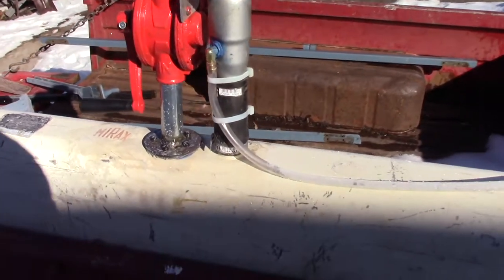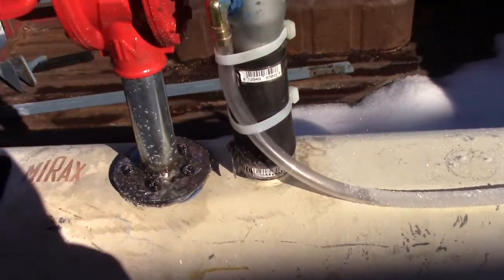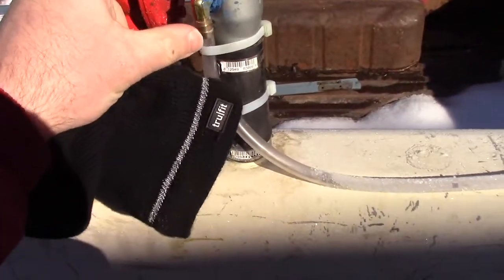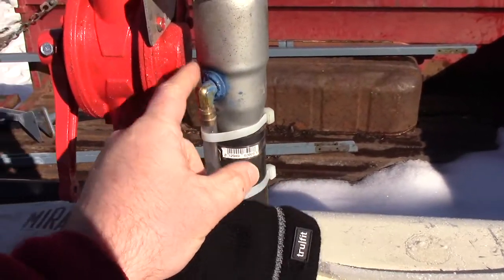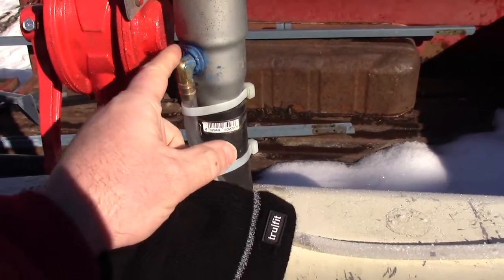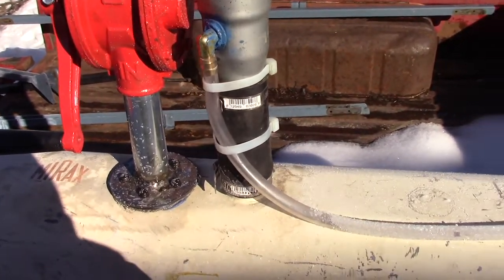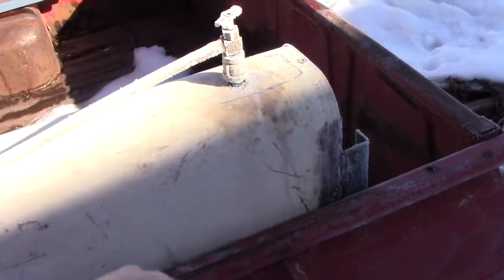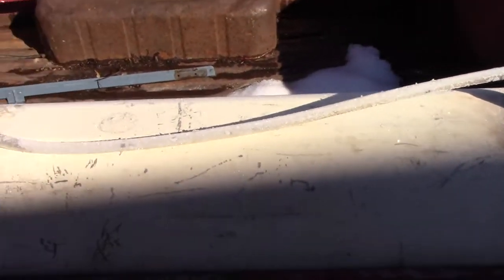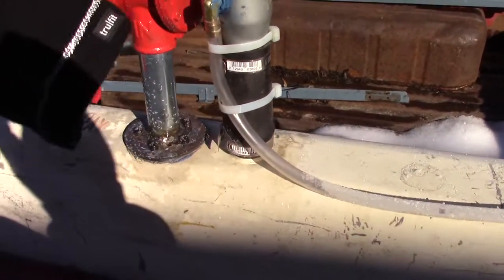We're a little frosty, but this is what we've got. This is mounted securely. To be honest, the pump doesn't shake all that much — I don't know that it necessarily needs a bracket to hold it up. Got our vent. I cut it off flush and threaded it in. It's a little loose — I got it gooped with some silicone. We'll have to see; it is just a vent. There's some vent line. I don't know when to buy anything, so it's an old radiator drain valve, but it's the right size. Probably going to get a bubble down in there, but once I start pumping it'll snort all that down and be fine.